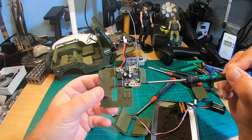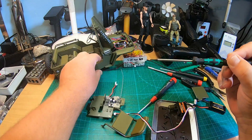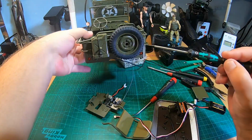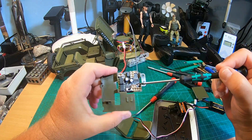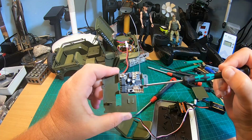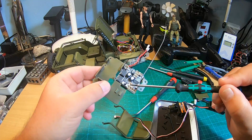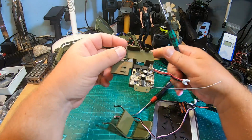small 2-pin JST GH 1.25mm housings for all 7 lights. So it has 1, 2, 3, 4, 5, 6 and 7 LEDs, and every plug of each LED has its own separate housing. I recommend taking pictures before disassembling. I marked the plugs with colors to make it easier to reassemble it correctly.